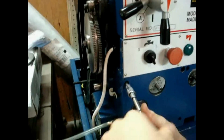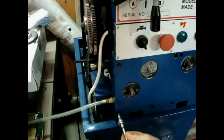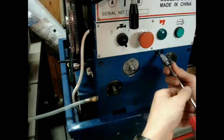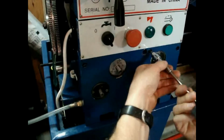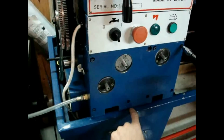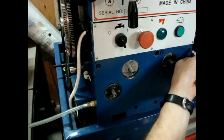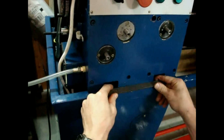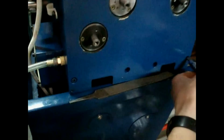Now there's another cork gasket under here, and since I have already replaced mine with... I tore my cork one originally because I wasn't careful enough when I removed this. It kind of falls off, so you have to be a little careful that when you take it off it doesn't just fall off. We'll see if it's going to do that when I get these all loose. And you could place something under here to shim it and hold it there. So let's go ahead and do that. That should be plenty. And we can take all of these and it shouldn't go taking off anywhere on us.